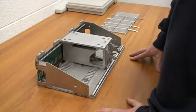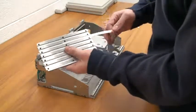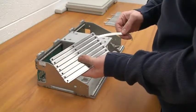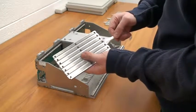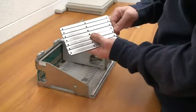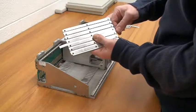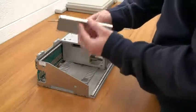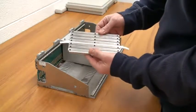Once it's snapped into the feeder base, we have individual matrix trays — in this case, this is a matrix tray that holds an 8mm paper strip. It can be loaded into any of the slots on the tray. It snaps into position, which should repeat and be the same for each slot. Once you have your strip into the tray, you can peel back the mylar covering the components.